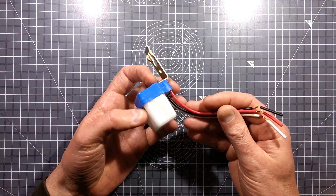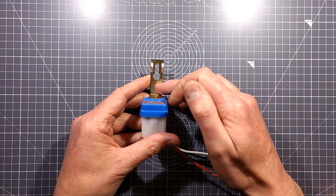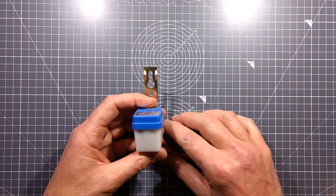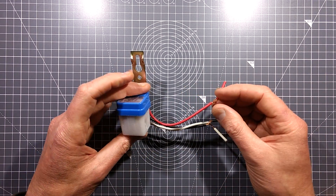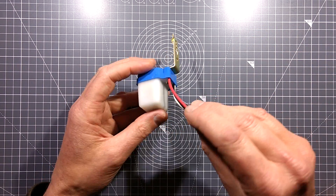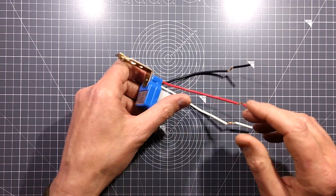I'm not sure how this is designed to be mounted. It's a dusk sensor designed to turn on street lights and general lighting. It's clear that you put a screw in the wall and hook this on over, and presumably that's a locking hole for putting another screw in the bottom, but then it's just loose wires coming out. In the UK, you'd really need to put it in an enclosure with a clear cover. The wiring colour code follows the American colour code: black is live, white is neutral, and it switches over to the red which is the load.